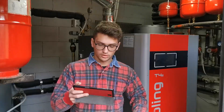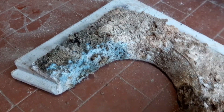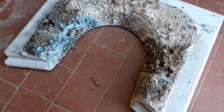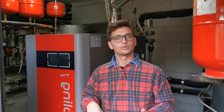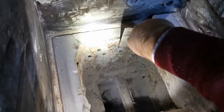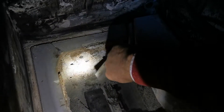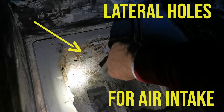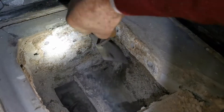It is very interesting to notice the residuals on this refractory material plate. You can also appreciate different colors, probably due to some oxides or other combustion residuals forming at really high temperatures. At that point we can access the heart of the boiler — the combustion chamber. First, we clear the four sides to open all the lateral holes that are required to let air pass inside the combustion chamber.